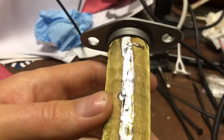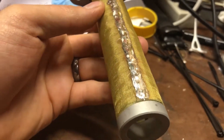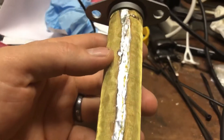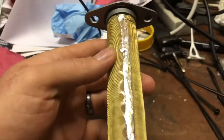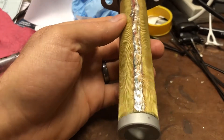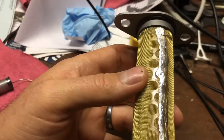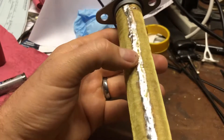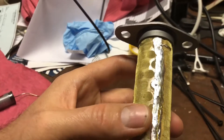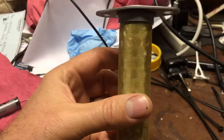The solder does not want to stick too well to the stainless steel. There is a ridge here where the steel met the steel — the whole stuff is wrapped around on each other and the solder went into that depression and holds it that way. It is not truly soldered onto the surface. I did line it up with the seam like the factory did, which makes more sense because there are more holes available elsewhere where it doesn't overlap.